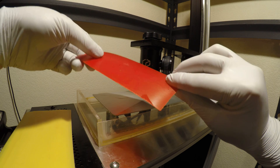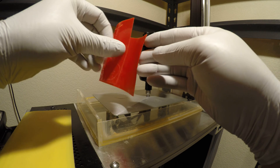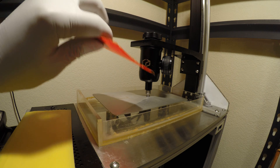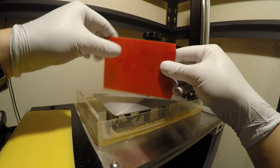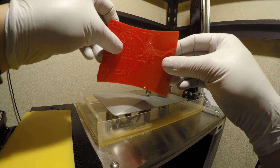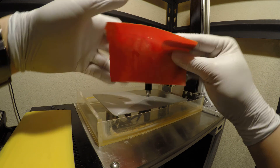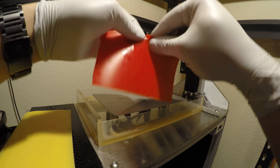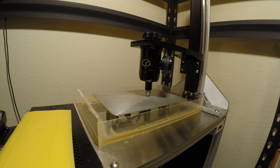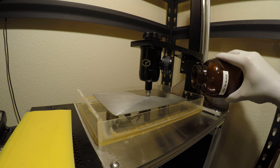The standard blend is Shore D 35. It is easier and produces a better result. You need to be careful because even though it's Shore D 35 and flexible, it is still a photopolymer resin — it is brittle and can't handle the kind of deformation you'd expect from a thermoplastic. You can essentially just tear this apart, so it's not as tough as you might think from its flexibility.